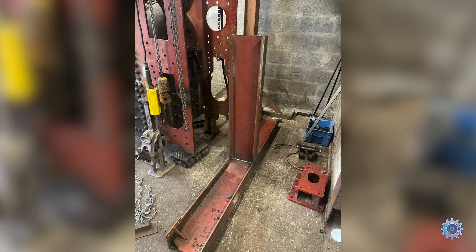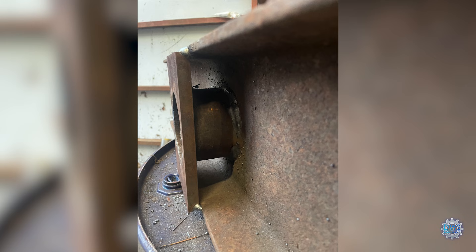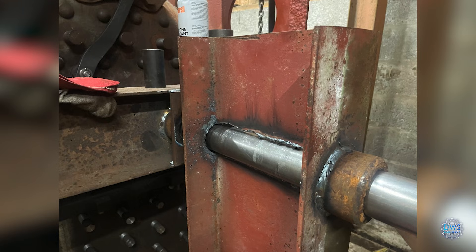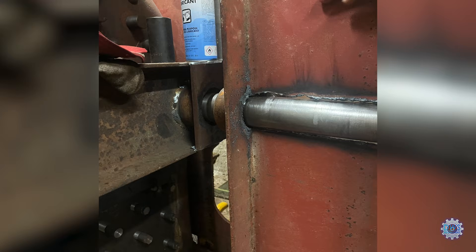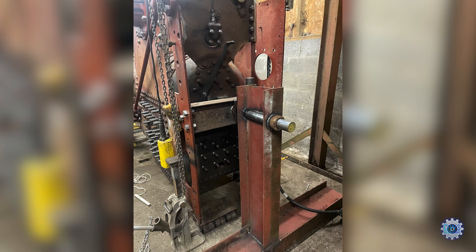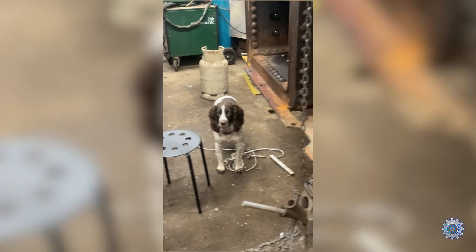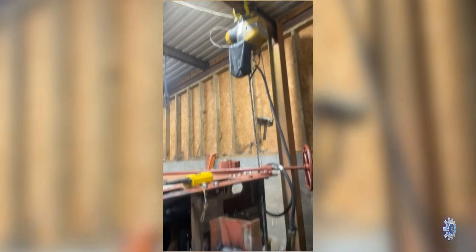After that I had to make a rotator to enable me to rotate the boiler — almost like a rotisserie. A couple of pieces of plate to make up the assembly, front and back. So there's a front carriage that I had to make as well. But it did work quite well — as you can see, we can just turn the whole boiler on the ground free.